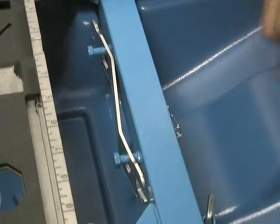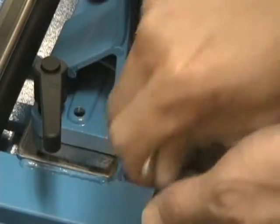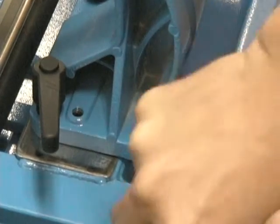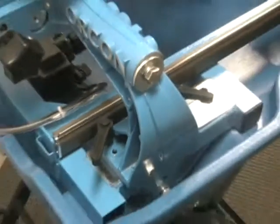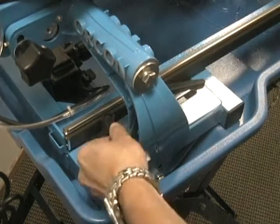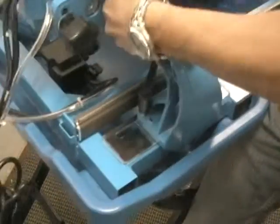There's even an onboard place for your universal wrench and allen wrench. These tools come in handy when adjusting the cutting head's forward adjustment. Loosen the two black handle bolts by lifting, lowering, and turning clockwise. This releases the cutting head block from the frame, letting you move it forward for smaller cutting jobs.